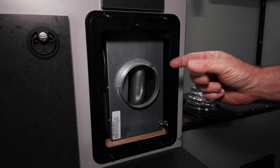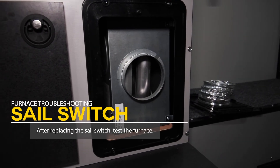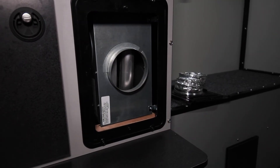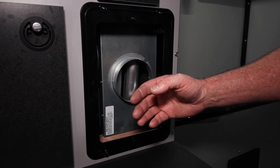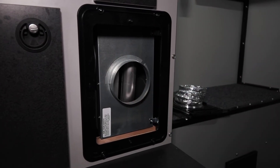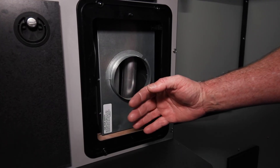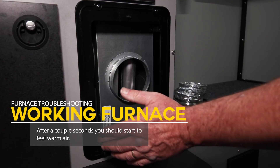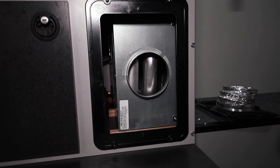We're back in the camper. We went outside and replaced the sail switch. We've got battery power, propane in the tank, we hit the reset switch, and we popped in a new sail switch. Turning it on — it's quite loud in the shop right now with saws going, so I couldn't immediately tell if it lit, but I'll know in about 20 or 30 seconds if heat comes out. I have a feeling it fired right up. Fans going, propane's flowing, burner's burning — and yes, that was it! We're starting to feel it warm up.